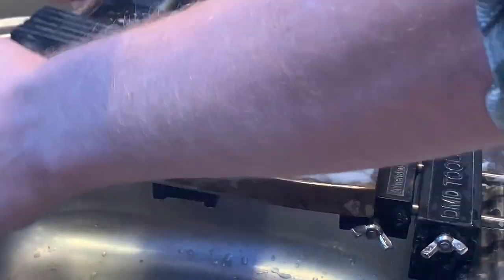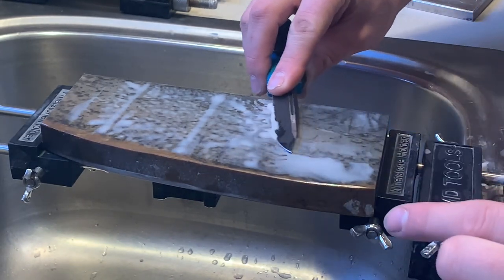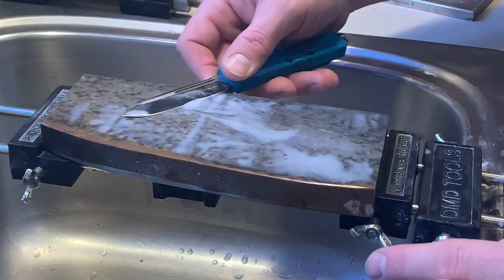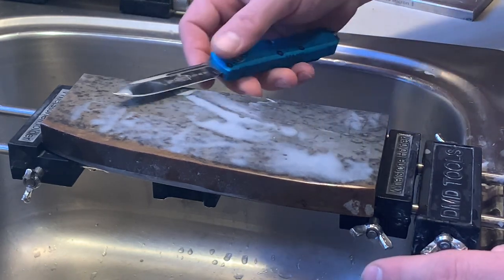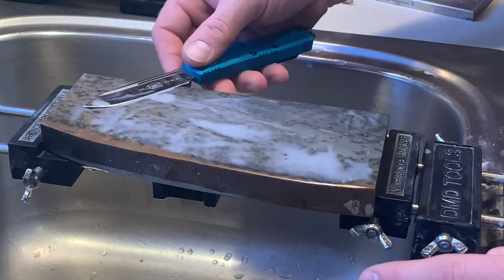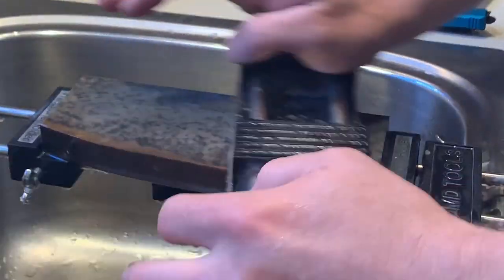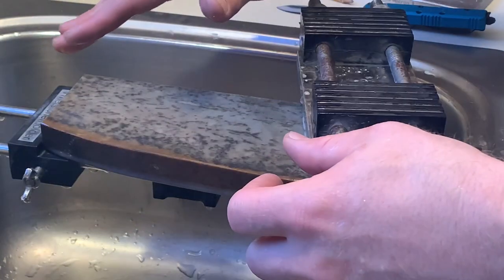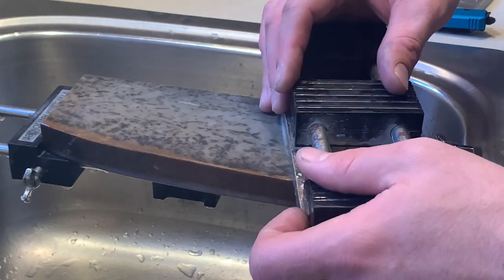An ultra hard, ultra dense stone like jasper is a real workout to lap, and it shouldn't be nearly as difficult to lap synthetic alumina bonded and resin bonded man-made sharpening stones, whereas jasper is extremely difficult to lap. I can still see a bit of my pencil mark here so I'm going to give that spot a little more attention, but I wanted to demonstrate why slurrying the stone is good. To recap: if you slurry it, you clear the steel, you free up freshly pulverized ultra fine silicate abrasive, and you'll notice that the cutting action is quickly increased.